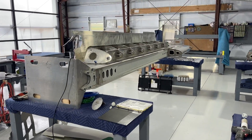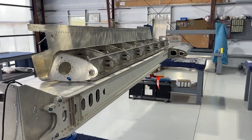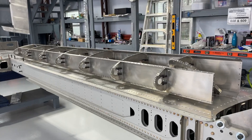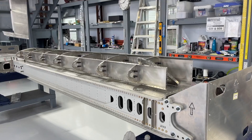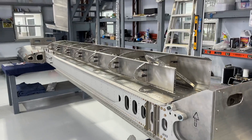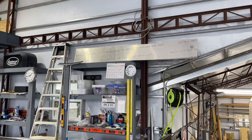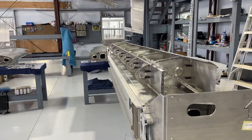Once I get this finished I'll put that up there, but the reason I can't continue on with the wings is I've had a couple of issues with parts. This is the right wing and the right fuel tank, and the skin was damaged in transit — a little piece of metal underneath the skin made a small indentation, and it almost looked as if it fully penetrated the skin. I didn't feel confident or comfortable continuing on using that skin, so Sling is going to send me another skin which is on order.